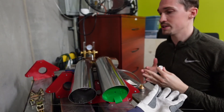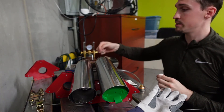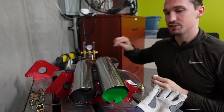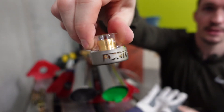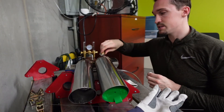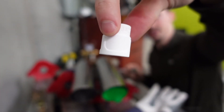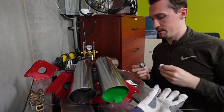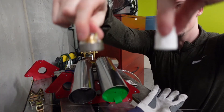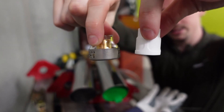As I'm finishing up this welding job I'm getting to the most difficult weld of the whole project — in between the pipes here, the last joint. Usually I use this big 19mm cup which works amazing for gas coverage, but because this is such a tight space that cup is going to get in the way. I have a 10mm cup here which gives me a lot more room to get in there. It's still going to be tight and difficult, but the difference between the two cups is pretty big.